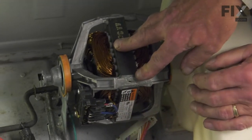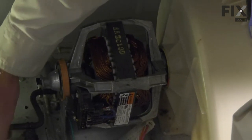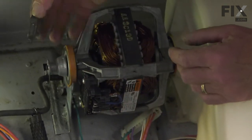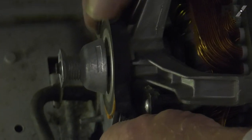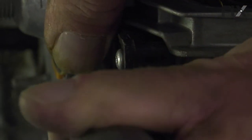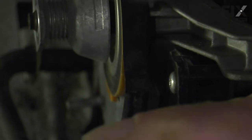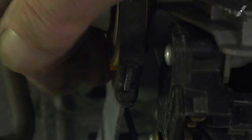The switch should be in a vertical position at that point. Take our spring clamp and hook it onto one side of that motor mounting bracket. Center it over the mounting bushing. Using a flat blade screwdriver, we're just going to press that down until it hooks in on the opposite side. Make sure the slot in that spring clamp is lined up over top of the tab on that motor mount. Then snap it into place and make sure it's hooked solidly on both sides.